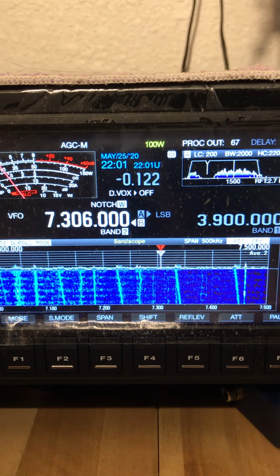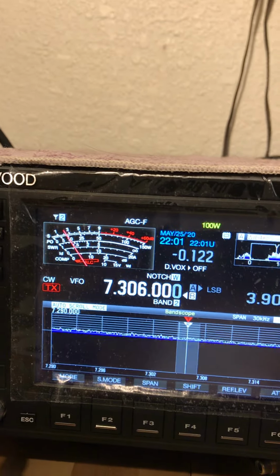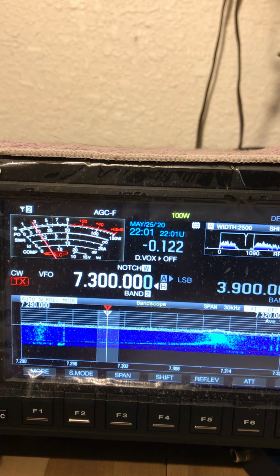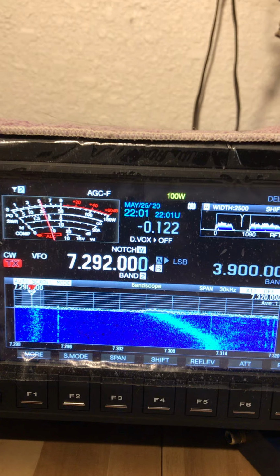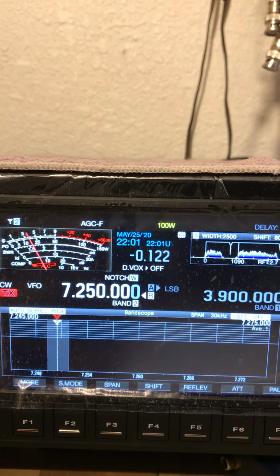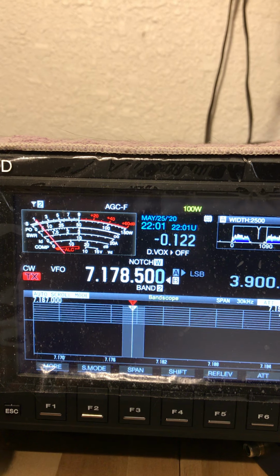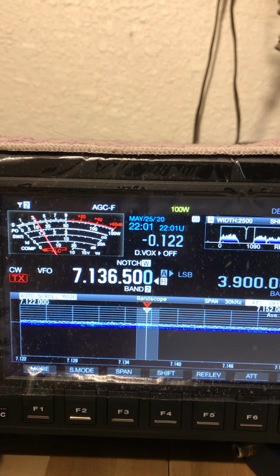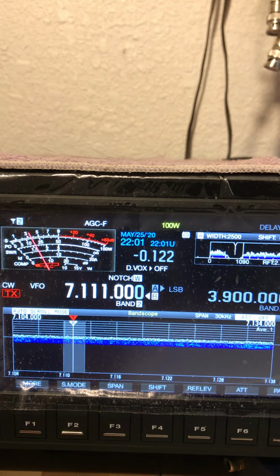Make sure that we're on the right antenna and I can transmit. SWR. Go to CW. Ooh, SWR is pretty high. But I'm also pretty high in the band. I'm not sure where that thing is tuned. Obviously pretty low. See the SWR going down, down, down in there. Not supposed to do this. Are you transmitting? Excuse me. Okay, I must have that pretty short.